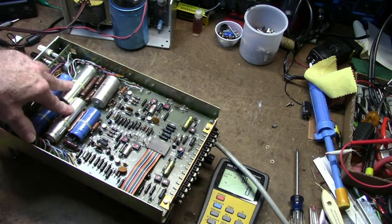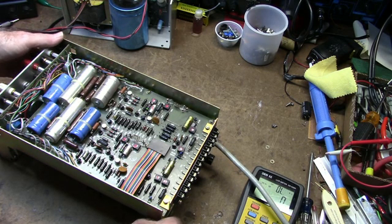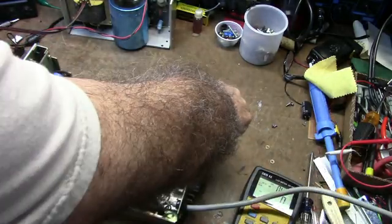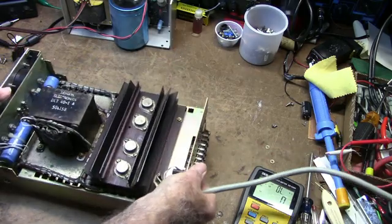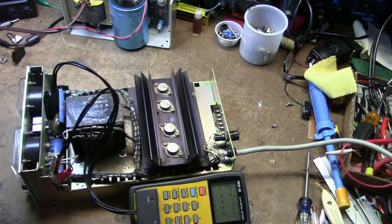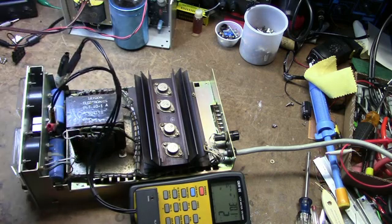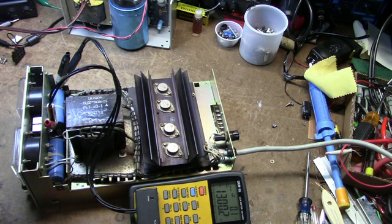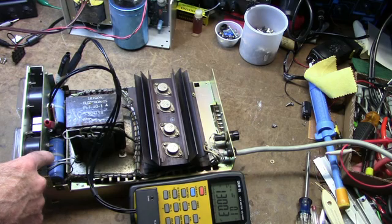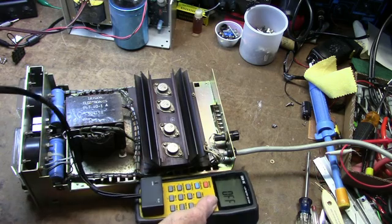A lot of people just automatically replace all the caps. You don't really need to do that — a lot of good caps get thrown away. Don't just shotgun troubleshoot and throw all the caps away, because you're probably throwing away good caps that are better than some of the stuff you buy today. I've got two more caps on this side that look like Spragues. These are reading 0.0 ohm ESR and 0.1 ohm ESR — that's fine. I think they're over 1,000 microfarads. These caps are okay. It's just those small ones that are bad, and I'll replace those next.